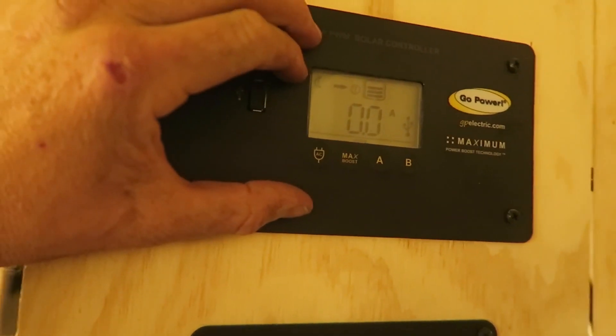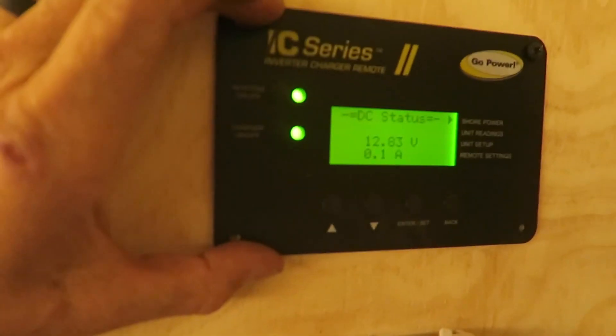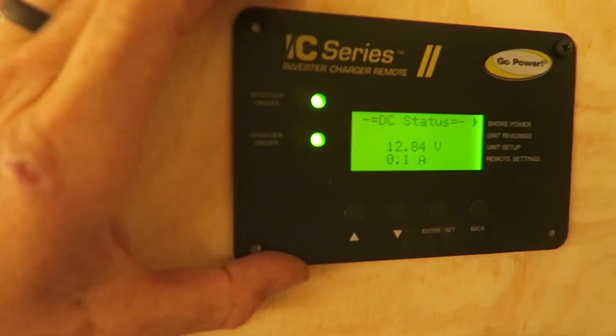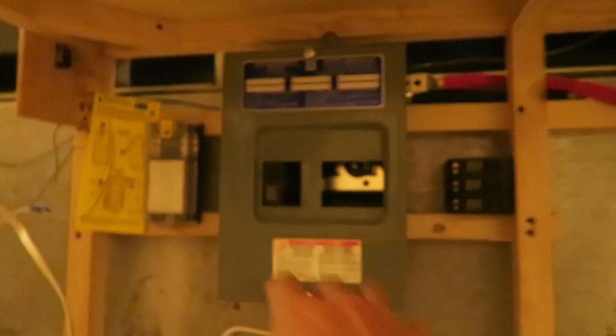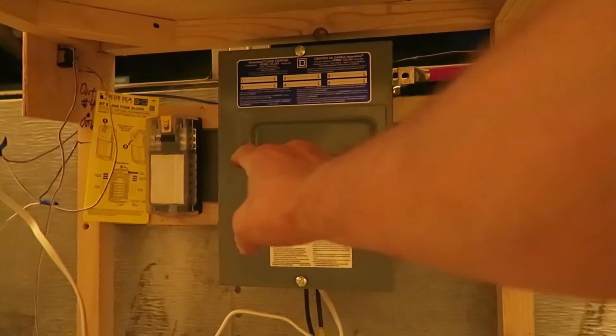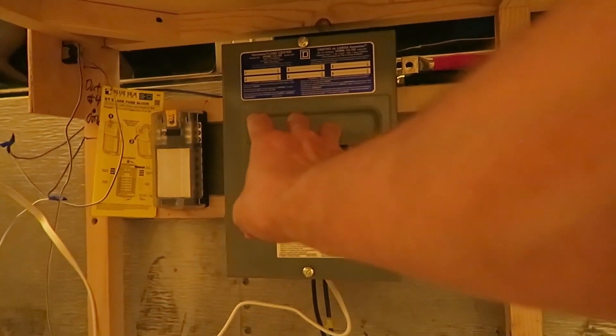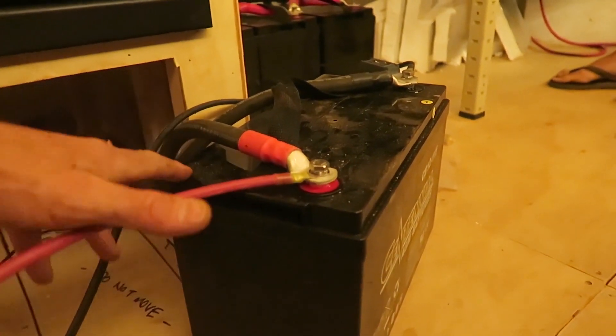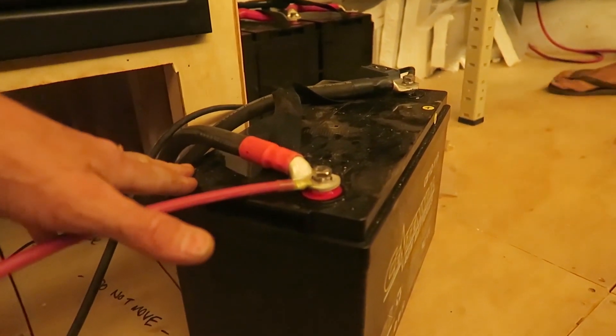Today I worked a lot on the electrical stuff. I wired up the inverter and I plugged it in and turned it on — that was really exciting. This is for the solar panel; it's dark so nothing's happening right now, but it's all wired into a battery and this is the inverter charger controller, which is theoretically turning the DC power of the battery bank into AC voltage. The thing is, it's not actually working. My sub panel is probably wired up incorrectly — when I flip the breaker on it just trips back to the middle. That means I must have a short or maybe I just completely wired it backwards. But the batteries are on and we could start using 12 volt with the solar-powered batteries, and I feel pretty confident that that system is correct. I just don't think I got the AC wiring right.